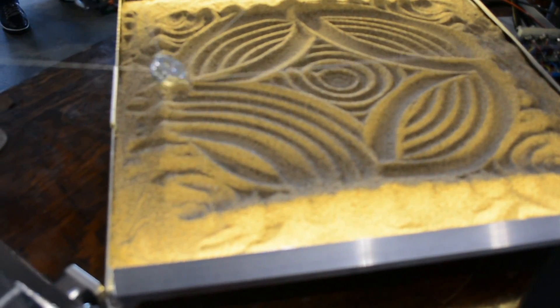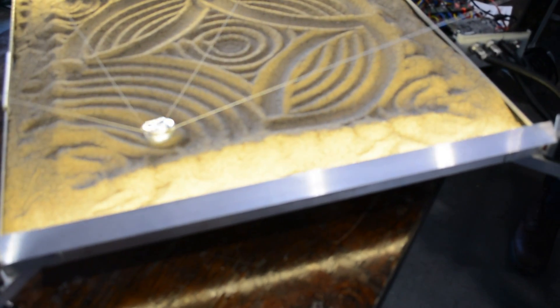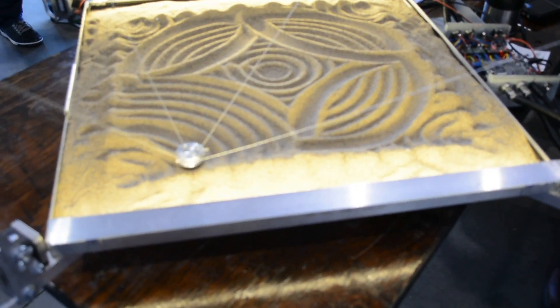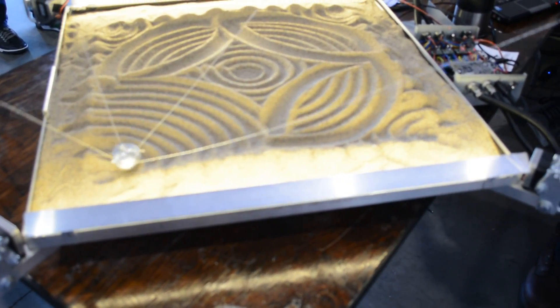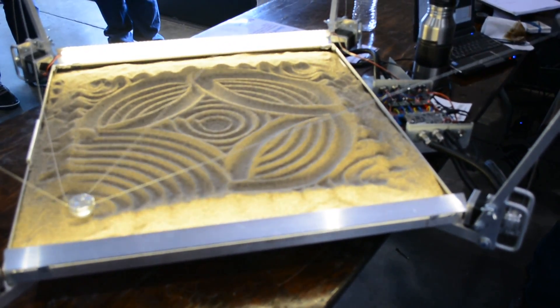So it's basically just a full CNC controller. It runs just like a mill. The only thing custom is it has a fancy kinematics module that will basically calculate the lengths of the string on the fly several thousand times a minute, and then voila.